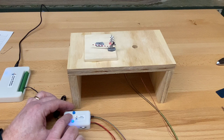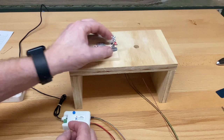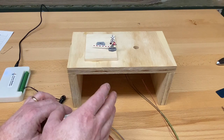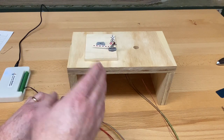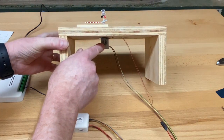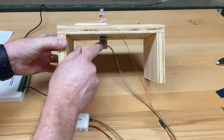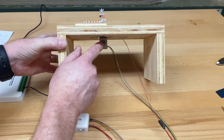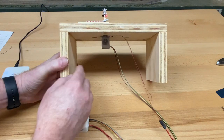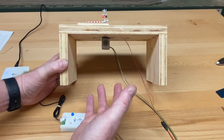And that's it. Okay, so you can fine tune that quite a bit, but that's the basic concept. We custom cut the wire, we custom adjusted the spinning of the wheel. Now, in this case, since we're using the hole that's closest to the center, we're using the entire rotation, well, it's really half a rotation, to go the 5 millimeters that is necessary for the gate to go up and down.